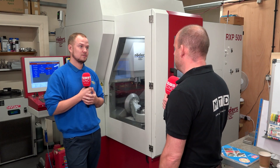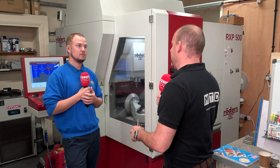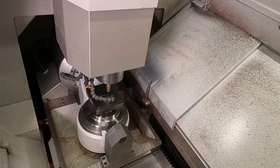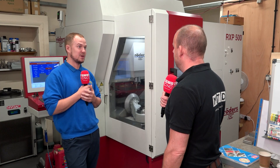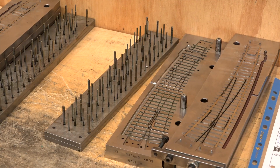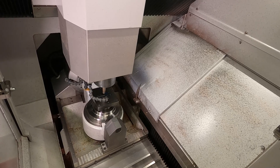When you're going up to 42,000 RPM, what determines machining at that speed — is it down to the size of cutter? Yes, the smaller the cutter you use, the more the spindle speed will go up to deal with the pressures and torques of machining. We use down to a 0.2mm cutter, which is incredibly small — you're talking about two pieces of A4 paper pushed against each other. We generally use very small depth of cut and pass over to cut with those kind of cutters.